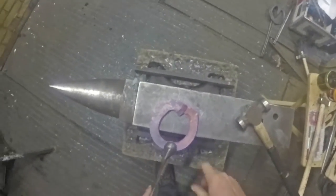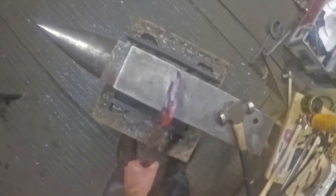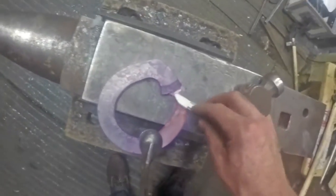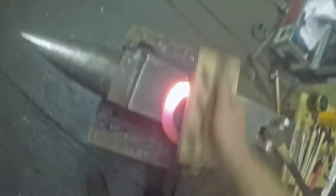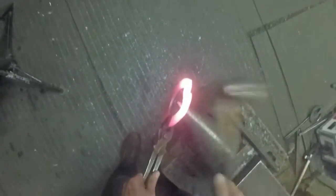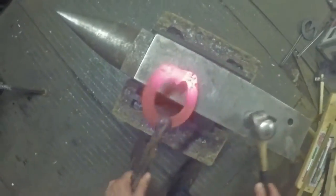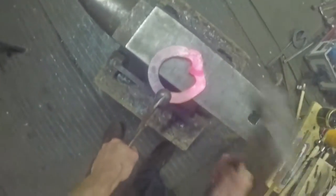It's not quite ready for welding yet, it just wants setting up a little bit. But what I've done is intentionally left that wider - whenever I've hockey sticked it round it's made my section a little bit thicker, so when I'm scarfing I can afford to dent that surface knowing I've got enough tolerance to forge it out afterwards. I'll put it back in the fire and get a nice scarfing up heat. Setting your welds up is probably more important than welding - if you get your bar set up nicely to start with it just makes your welding so much more simple.